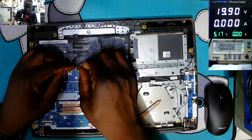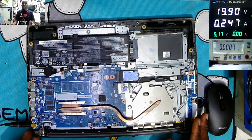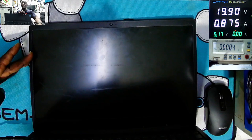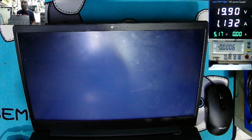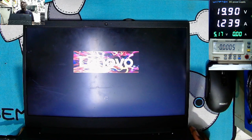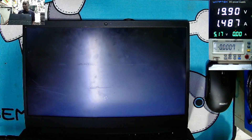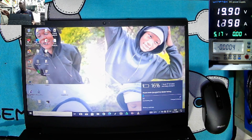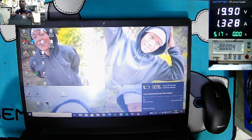Let's connect back the battery and plug the power supply. We still have the orange light, and now checking — 800 milliamps. Now it's a different story. Pressing the power-on button — 1.1 amps. Now 1.2. Now 1.4. Now it's taking around 1.1, 1.2, 1.3 — and the current is rising.